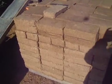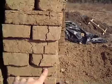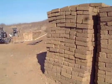As far as the bricks themselves, a lot of them came out quite good. Some quality control issues — some cracking, definitely. It's important to lay them really flat so you don't have stresses on freshly produced bricks. Here you can see some major cracking issues on the bricks — a lot of stress on them, and the bricks may not have been laying flat. So there are some problems in quality.